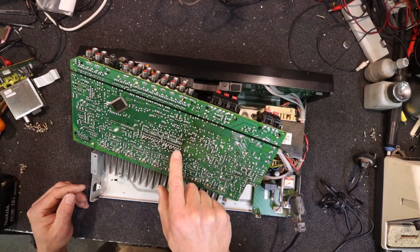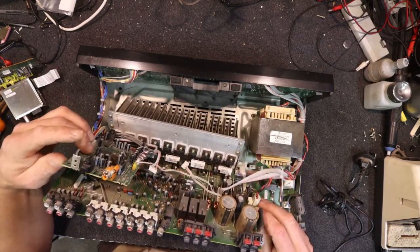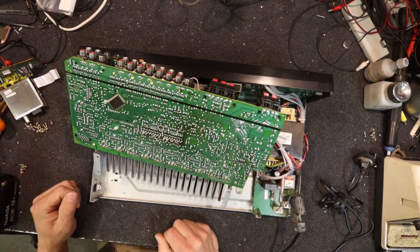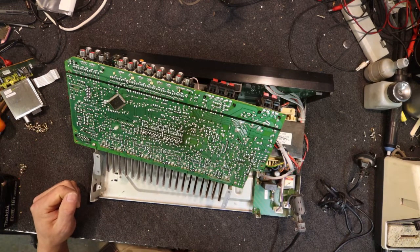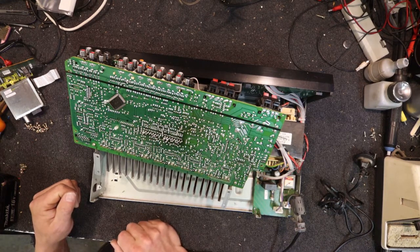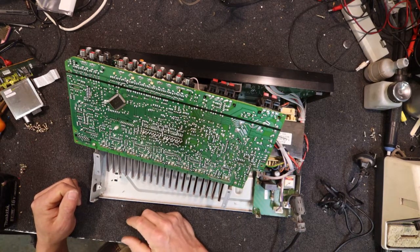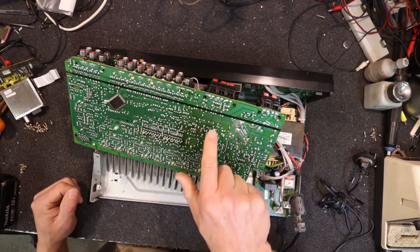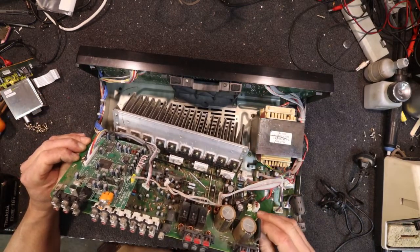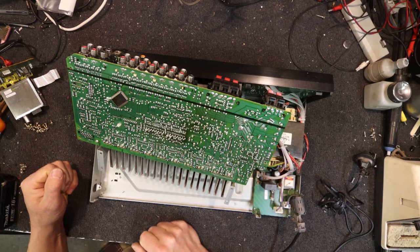This is the bottom of those two driver chips. There's also an STK or something chip - the STK 350 230 - which would be another driver chip, hidden under this other board. She's very close to needing a resolder - these joints are very close to dry, if not actually dry. They're common for doing it, these amp chips, because they run very hot, and probably the cooling and heating cycles are enough to cause these issues. Even the speaker relays - there's a bank of three relays in here because it's a multi-channel amp - and there's definitely dry-looking joints starting to show on those.